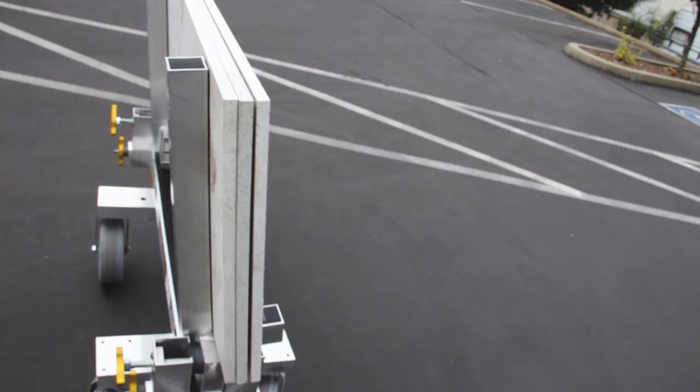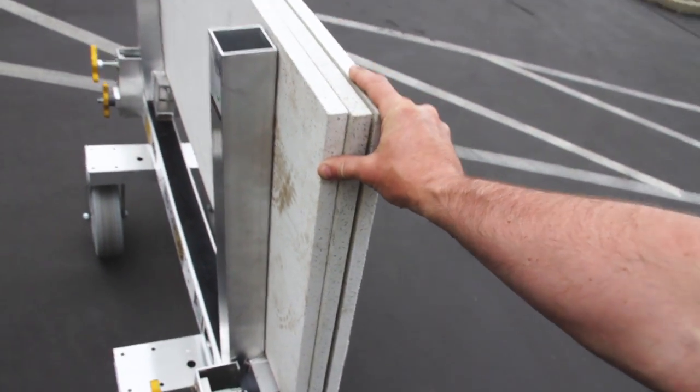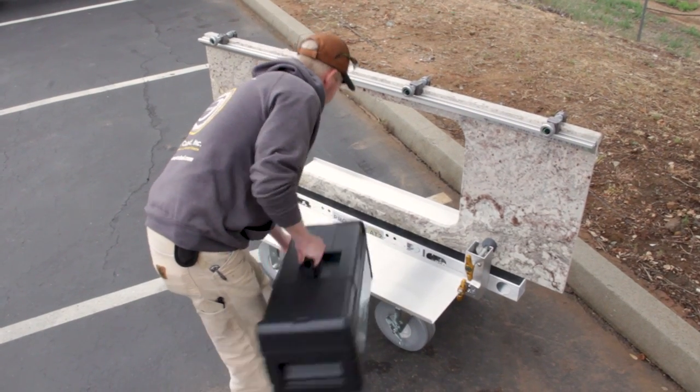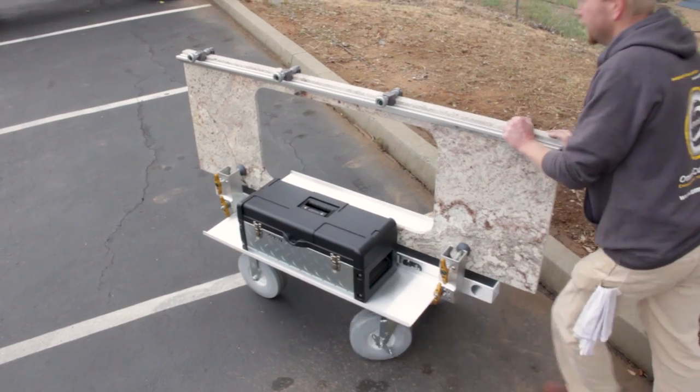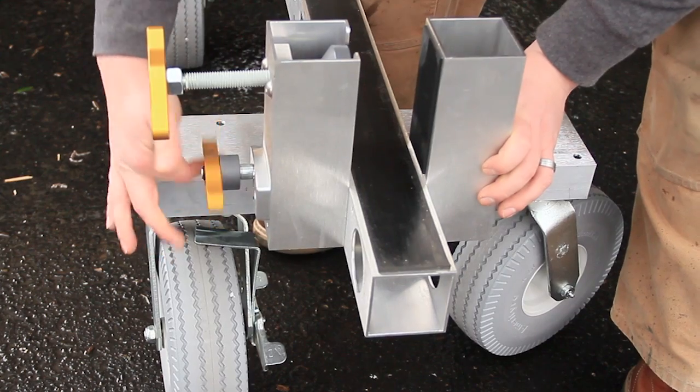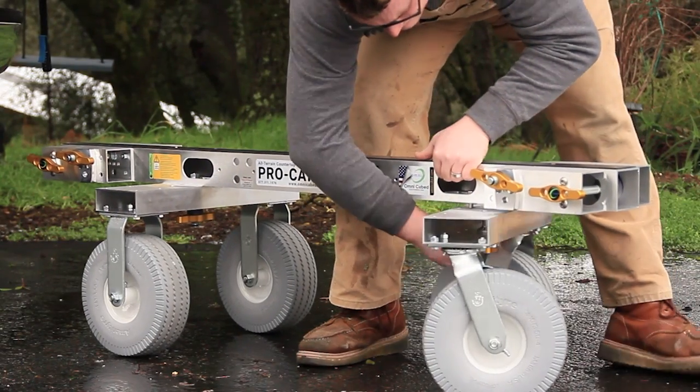If you have lots of repetitive work, you can move several small slabs at once by adding the multi-top accessory. You can even throw on a set of tool trays to carry all your gear in one trip. And paired with an OmniCube single saver and a set of aqua jaws, you've got an install kit to handle moving just about anything. And to pack it out, fold down these clamps, fold in the caster rails, and then just slide it in your A-frame.